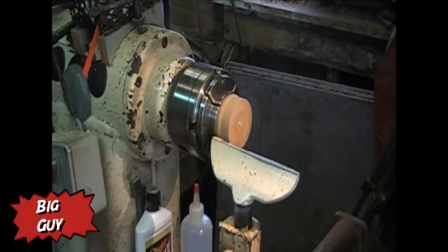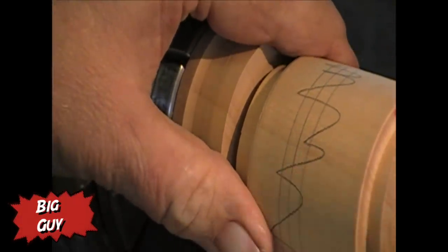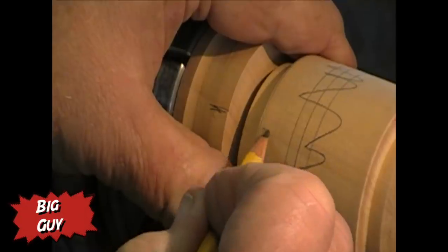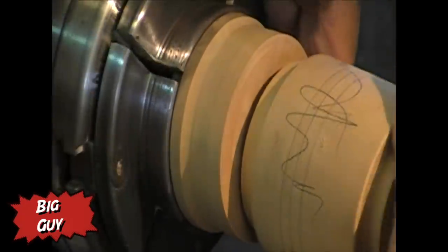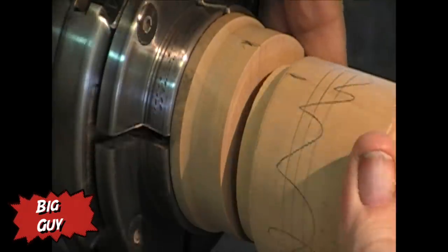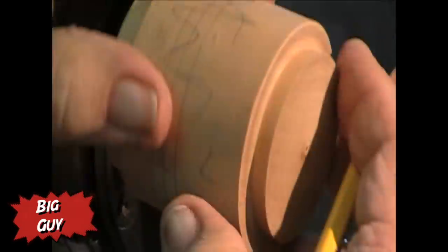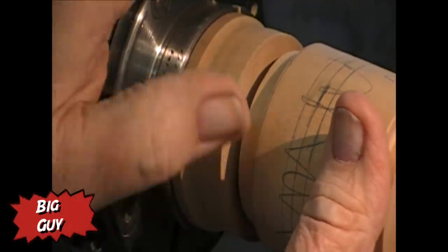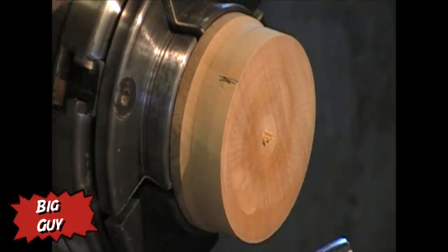Now that's out of the way. Looking out the back windows — sometimes these are the front windows — I forgot to reference the grain. This line here and this line here, if I put them back together, it's a great reference to the grain. If I had a radical change in the grain with a color shift — and I have one right here — here's the color shift from this point on down. I have another color shift on the other side. So if you're really interested in making it look like just a barely-there line and not a big seam, you want to reference the joint.